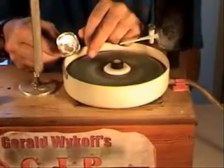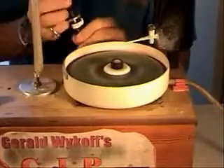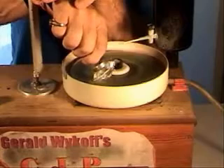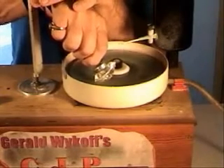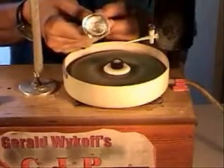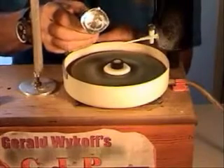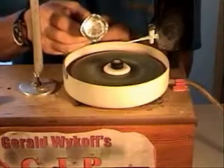This is a 50,000 grit diamond wheel. We change the address for the next facet, go into the proper number, search out the proper angle here, and polish the next facet. What you're really doing is going round and round, each one of these notches corresponding to one of the facets, and just cutting around until you have a marvelous and pretty good replica of the world-famous Jubilee.